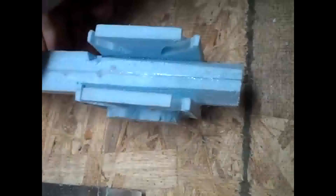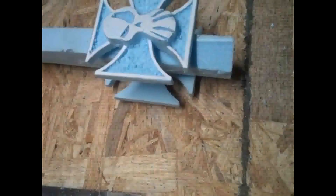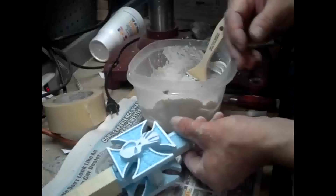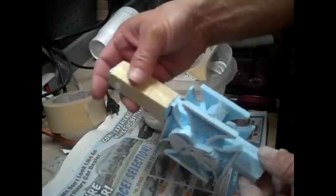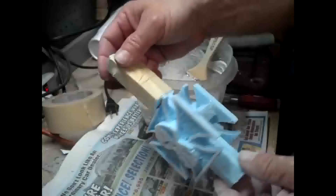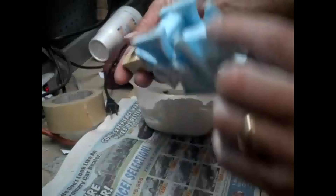I think I'm going to put some feeds across here too to make sure everything feeds properly. I forgot to mention I put masking tape around my sprue — I just think it helps keep the sand out. So I put little extensions across there to help feed it.